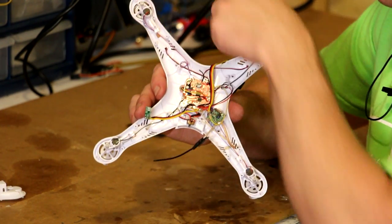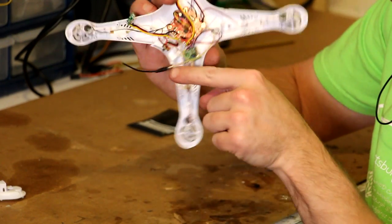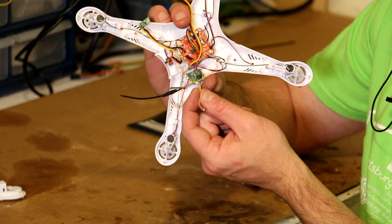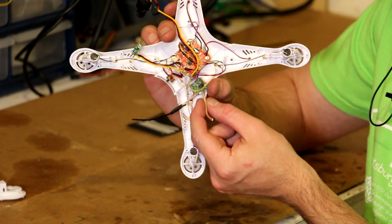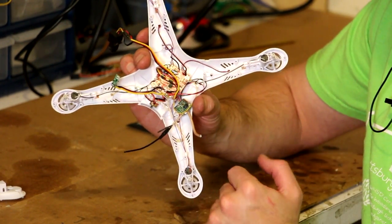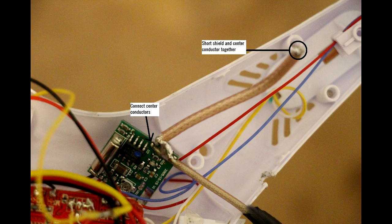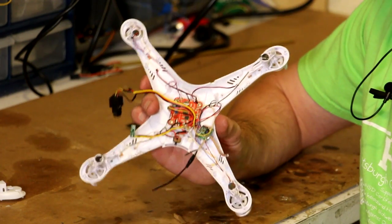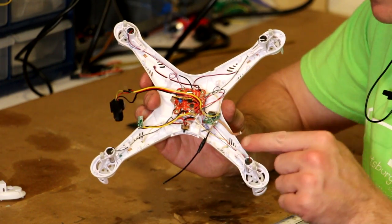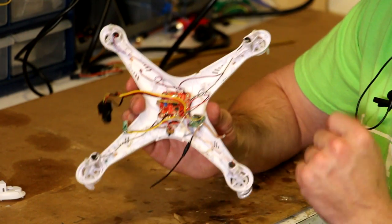To get the video, I simply connect the yellow wire from the camera to the yellow wire of my video transmitter. This extra piece of coaxial cable is a notch filter — it filters out the 2.4 GHz harmonic out of this video transmitter. Since 2.4 GHz is what we're using to control the vehicle, all you do is take a piece of RG316 cable, measure it exactly 1.6 inches long, and short it — connect the center conductor and the shield and solder them solid. This seems like a short circuit, but to RF it's not. Well, it is — to 2.4 GHz this is a short circuit; to 1.3 GHz it doesn't exist. Amazing thing about radio.